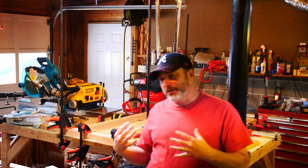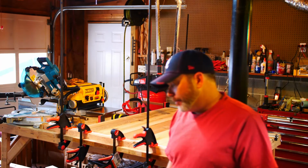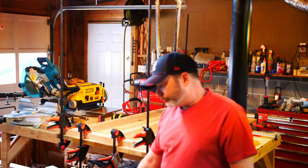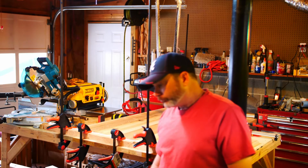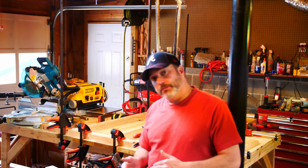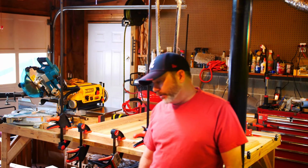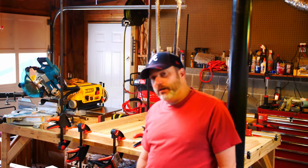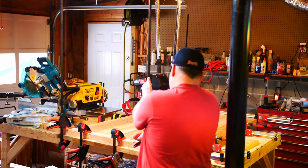But I got the tabletop glued up. We're gonna pop it out of the clamps, and then we're gonna move on to finishing our base. I've been working on the through tenons, and today I'm gonna work on pegging them. So I've got to do another mortise, and I've got to make some pins or pegs or keys, whatever you want to call them, to pin all that together. All right, so we're gonna pop this thing apart real quick and see what happens.